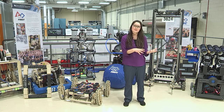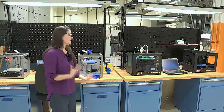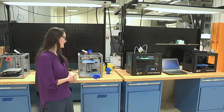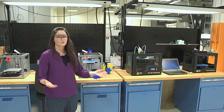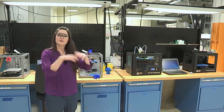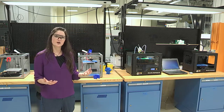Now we're going to go talk about some small scale or desktop 3D printers. These are our desktop or consumer-based 3D printers — the less expensive versions. I actually have one of these at home; it's the Solid Doodle 3rd Gen, it's about 800 bucks. These are really awesome for research because they are so inexpensive and they're pretty analogous to the larger scale FDM systems. In fact, the carbon-filled ABS that we use on the BAM system — which is why the BAM actually works today — was actually originally printed on one of these desktop systems. We found that with the desktop system, we had a lot more control and accuracy with a carbon-filled ABS than we did with normal ABS.